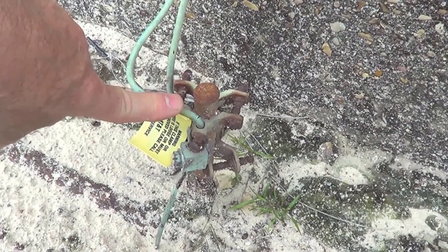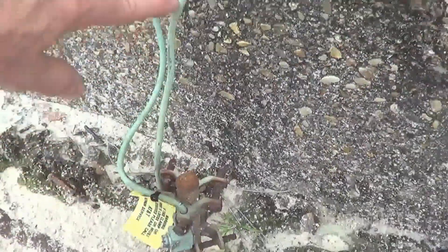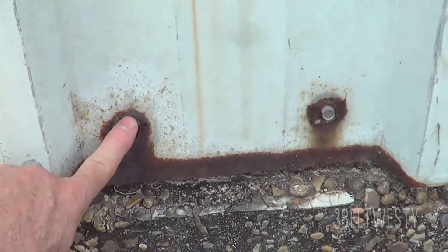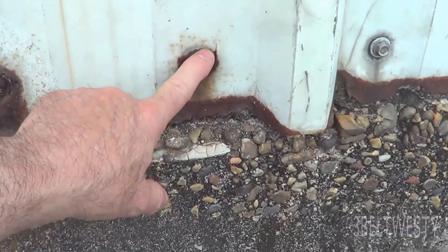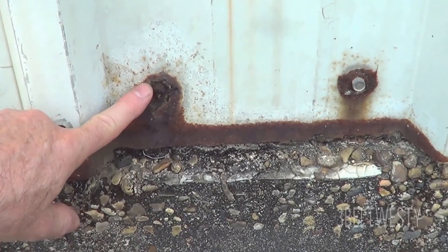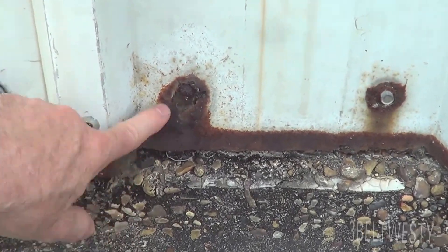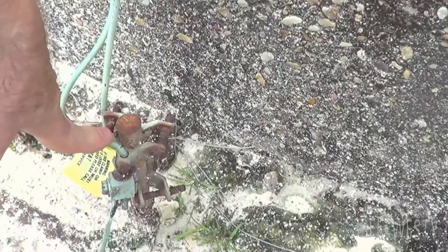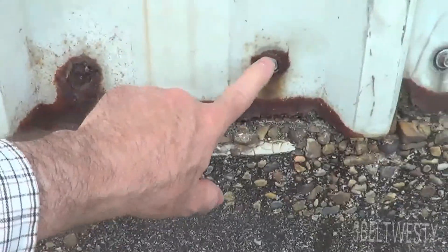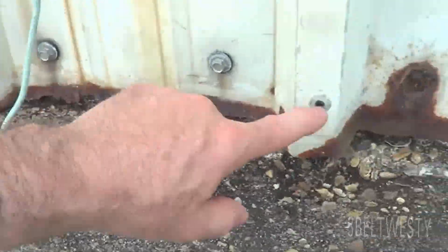Here's a ground rod for the meter box — this is a steel building. We've got some corrosion here in two places. What happened is there was a current flowing through the neutral; instead of going directly to this, it was actually going through a ground in the wrong way, and it ate through on here. It was accelerated because the current was flowing through the wrong path.